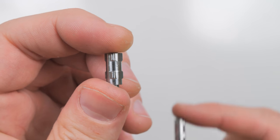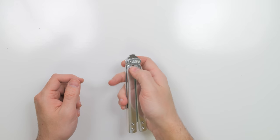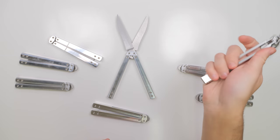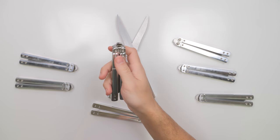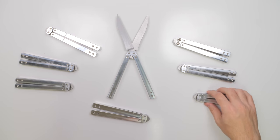For example, I made a pin with no chamfers on the lobes, which did lead to worse behavior, but not as much as expected, which is pretty much the result for all the tests I tried. Now I was starting to answer more questions than I was creating. My design seemed fine, I just needed to make things more reliable.